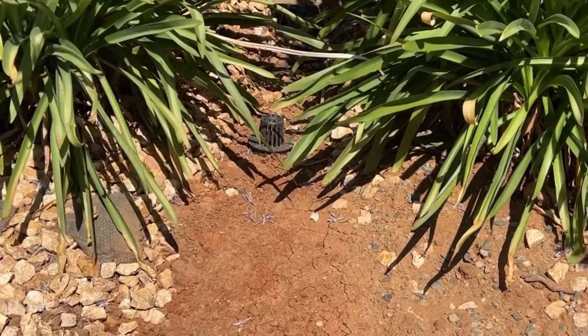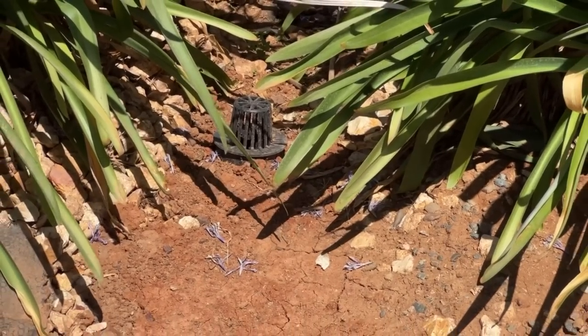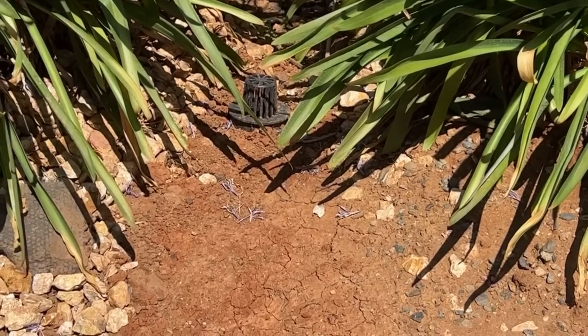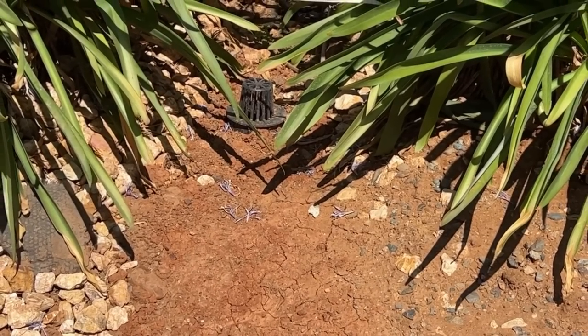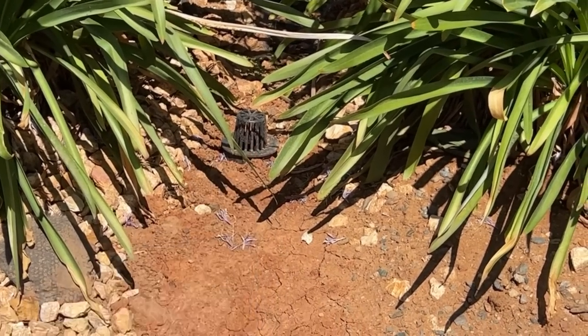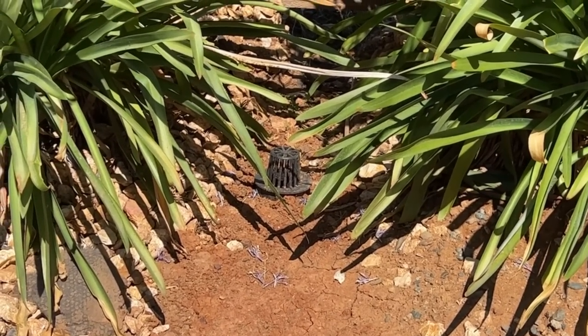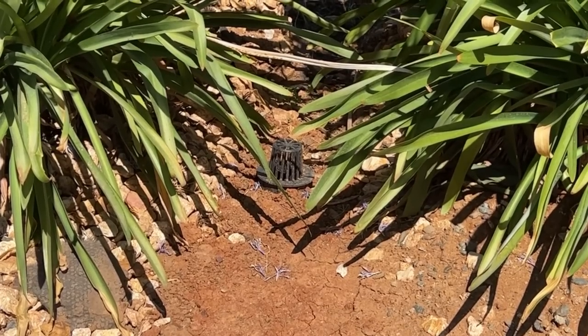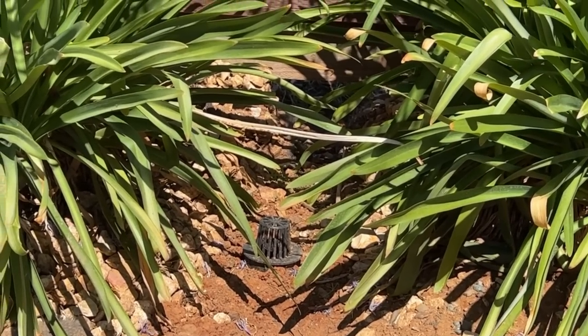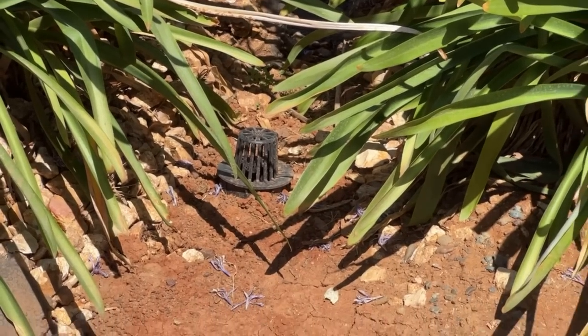I wanted to show you guys what it looks like all finished. So I pretty much just created a snorkel, formed a 90 degree elbow going up, added another piece of pipe about 2 feet or so, and then we actually put that little topper there. And then we have somewhere for the water to exit once that hydrostatic pressure gets relieved. It's gonna come out through that pipe and travel all the way through and out towards the back of the greenbelt.